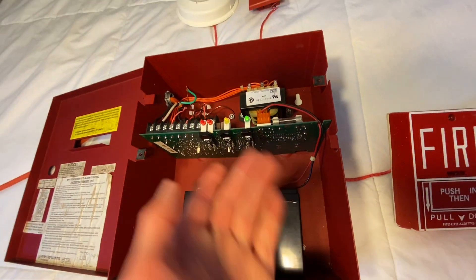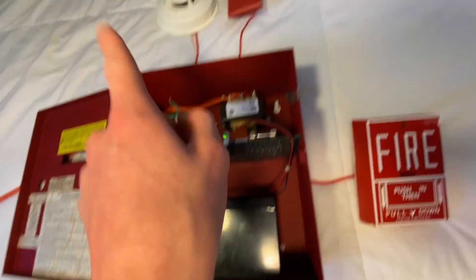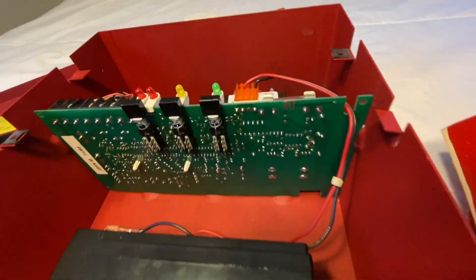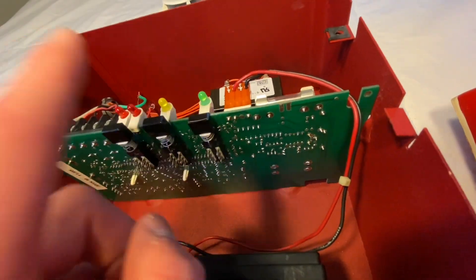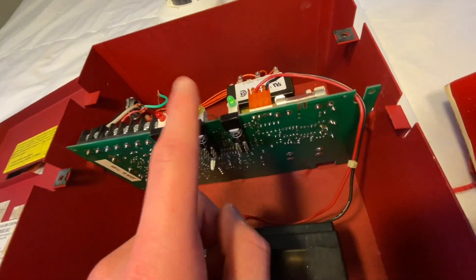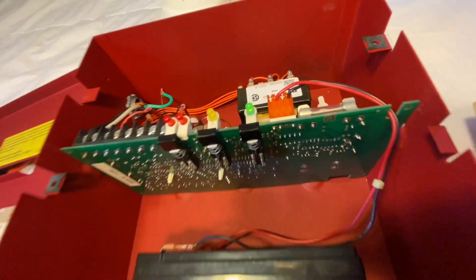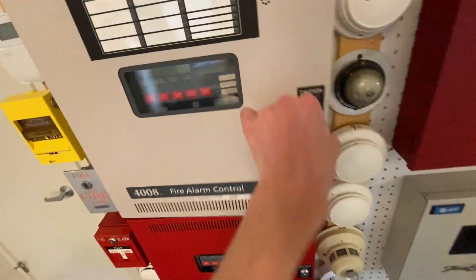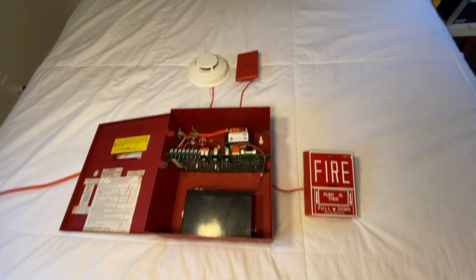The button below it is the silence button — or actually it's called disable. So if you activate the system and the horns are going off, that's what you hit to silence it. What's really cool about this is that you have to press it to silence, and when you're done, you actually have to unsilence it as well. When you silence it and then go to reset the panel, you have to unsilence it again — same with the trouble button. Most panels: you hit silence, then hit reset and it unsilences for you. But with this one, you reset and then have to turn it back on again.